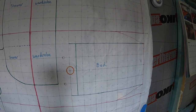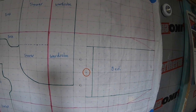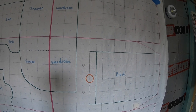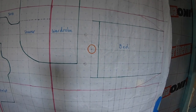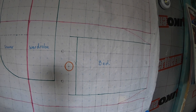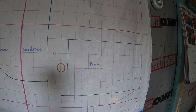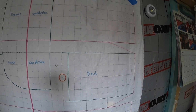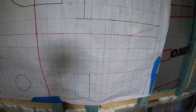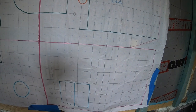Then the bedroom is really quite equal. Our bed is central, the water tank's underneath, so that's central. But then the wardrobe is slightly over to the port side. Well, it is over on the port side, and then you've got the doorway. So at the side of the bed, we're building steps and I'm making our bed a little bit higher just so I can get on. And under them steps, there's going to be access points to put ballast in them. So again, we can trim the bow out when we need to. We also have the hatch in the bedroom on the starboard side, which we obviously haven't got on the port side. So again, we've got that extra weight on that side.